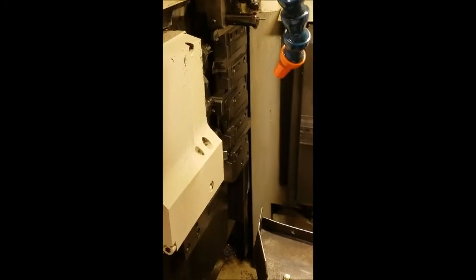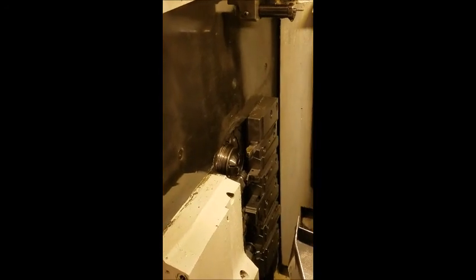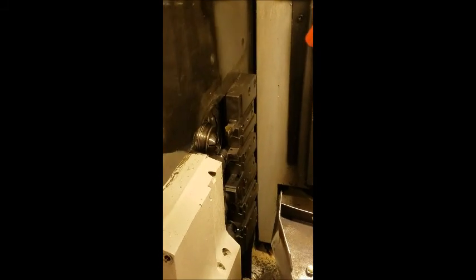There's our C-axis, follow up. T0101, and we're going to say M23 S1500, end of block, insert. Here's your live cross drills. G0 X0, end of block, insert. Here's a rapid,